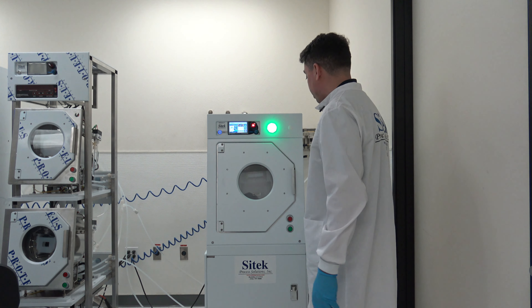Getting the system started up, we now have our typical one minute 500 RPM rinse. Feeling the side of the tool, I feel minimal vibration if anything, which is great because we have a brand new rotor in the system — everything looks to be running fantastic. Coming to the back of the tool everything looks great here as well. Obviously no leaks coming out of the system, and I see the full flow coming out to the drain in our facility setup.